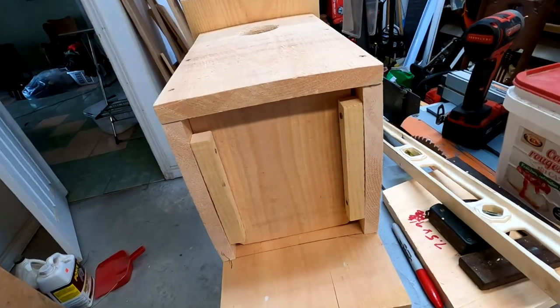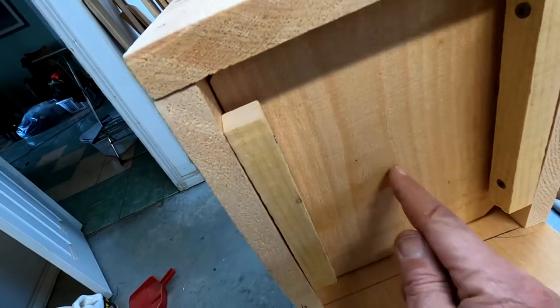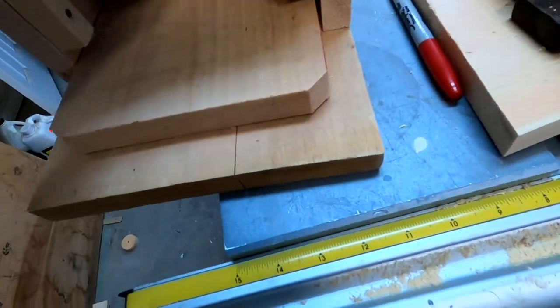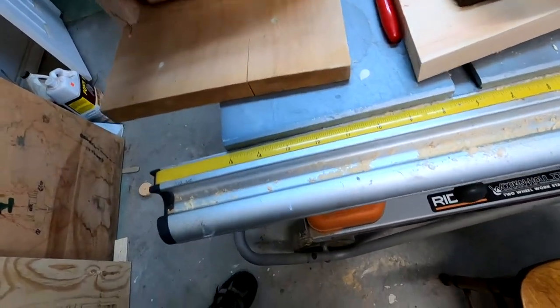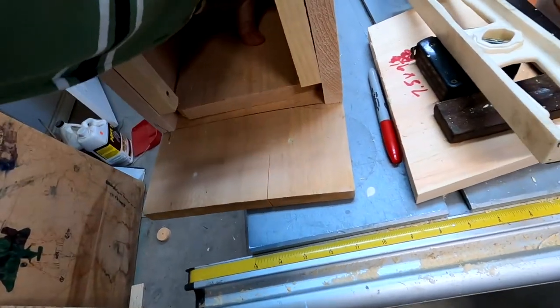This shows the bottom of the box. I've put two cleats of wood here — about one-by-one-inch chunks that I nailed and screwed into the sides — which hold the floor up at the right level. The floor is cut to fit loosely and sits on those cleats. You have to maneuver it in through the entrance hole. Once it's in place, I would put at least one screw on each side to secure it, because otherwise predators might be able to push it up from below.